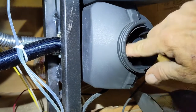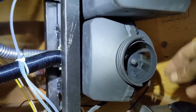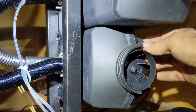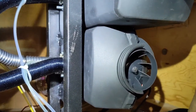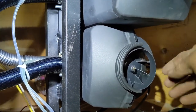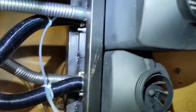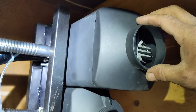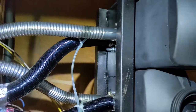This thing is giving me an E3 — Echo 3 error. There are magnets on the back of this fan and the unit checks to see that it's rotating. One of the magnets was sticking out too far and was catching, so I've got to fix that. But I did prime this one, and the upper one for the front room here seems to be working fine as soon as it finishes priming.